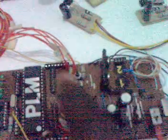You can see we have some status lights here, which are the status indicators, and they are connected from pin 16 to 23. On this side we have two push buttons which are used for inputs, to either start or stop or increase or decrease anything that the program wants. They are connected hardwired to pin 8 and 9. Don't worry about the wires, I will talk about the wires a bit.